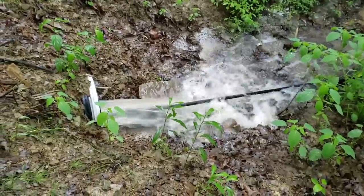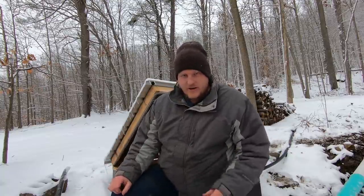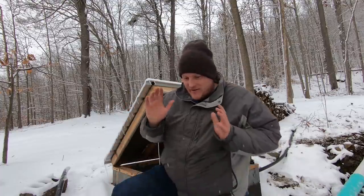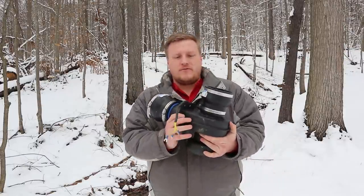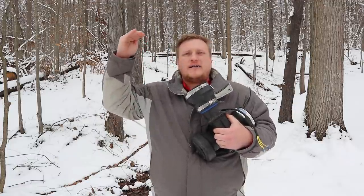I would only have enough water to run this during high flow events. That's it for this little project — it's been very wet, cold, and snowy, two days of work. Everything is working kind of how it's designed, but as you saw I didn't have enough water to keep this loaded for a very long time. I also didn't have enough water pressure to generate enough voltage, so I need more height to make it work properly. This would be a great turbine if you had more water and a little bit more head pressure.